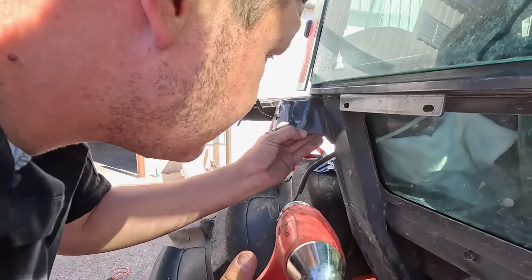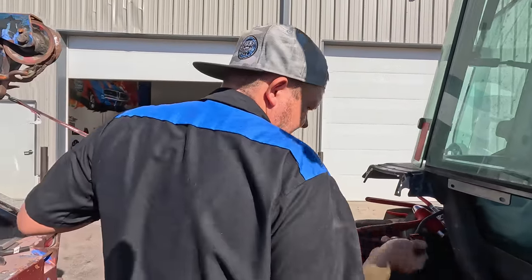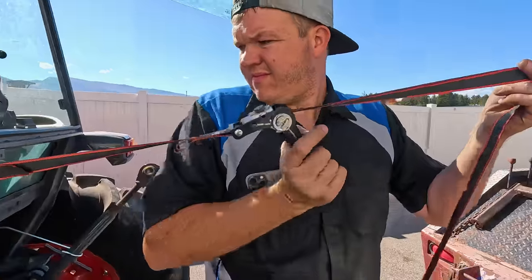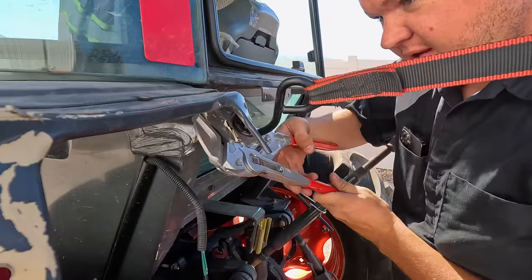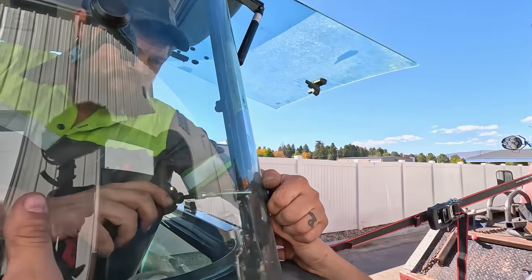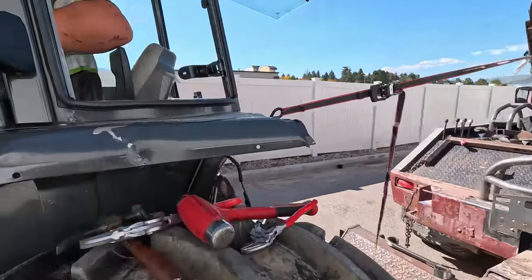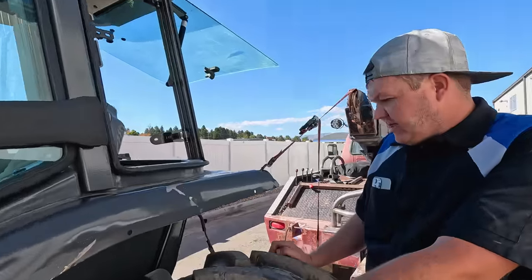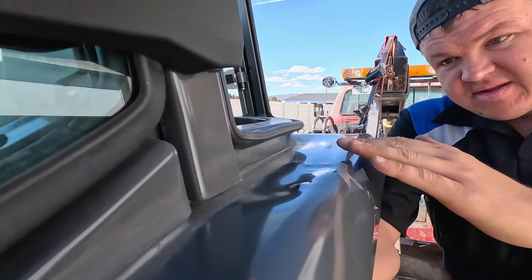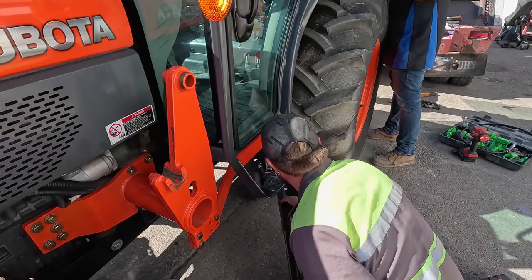We've got some stretched metal we're dealing with. We're gonna grab a few more tools and keep getting it straight. I'm gonna switch my hook over here so I can pull pressure and get that buckle to go back in. It's sort of going how it needs to - I've still got a buckle in here and we've got to pull more pressure out. With metal, you're basically trying to release pressure and manipulate the metal where it'll go back into place. We just realized I can't get a port-a-power in here and there's a brace underneath that's bent - that's why this is all dipping down. To push the brace up, we've got to pull the tire off, so Hillbilly's gonna grab a jack and an impact.